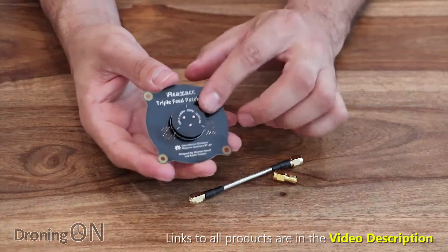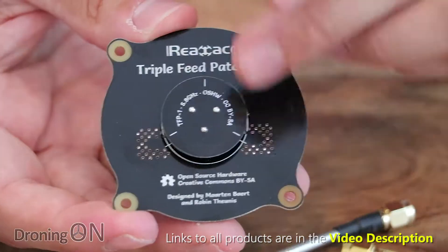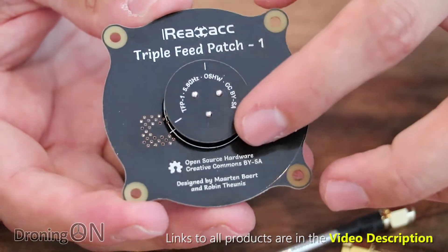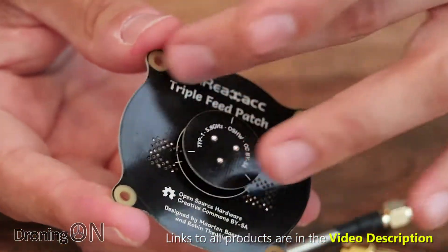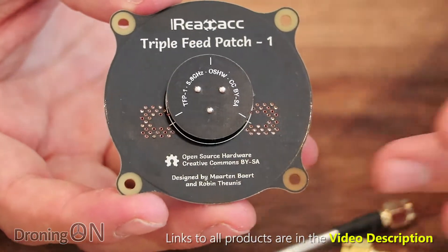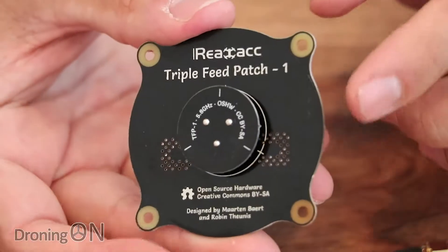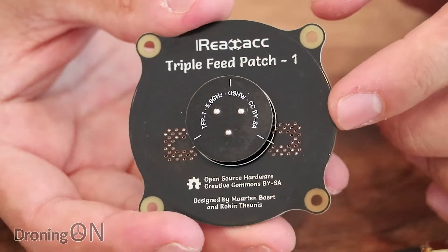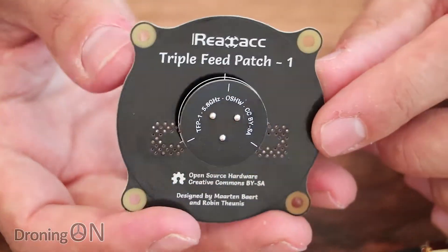It's not like your typical Pagoda antenna, but there is an element of it here. In the centre we've got your traditional Pagoda antenna, but rather than the lower elements of the Pagoda you've got this broad panel here. That means that rather than your traditional Pagoda which gives you omnidirectional feed, this is very much more directional. In addition to that we're getting a high gain of 9.4 dBi, but remember that gain generally comes with a more directional signal.